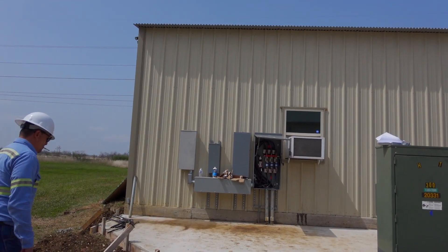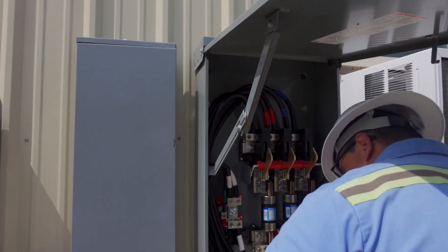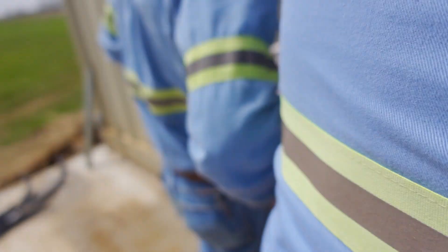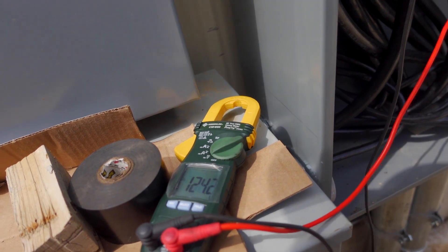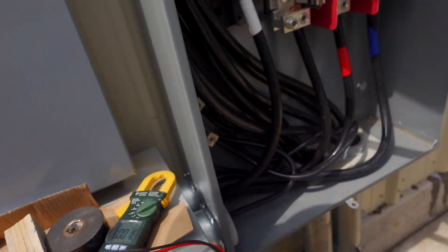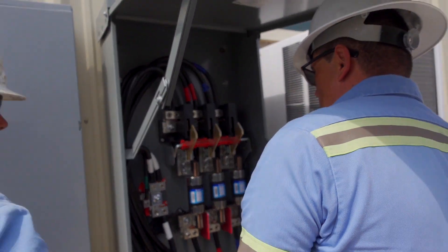It's hot. Now we flip that big switch — do you have your tester and gloves? Let's test it. We're reading 123, 124, 123 volts phase-to-neutral and 208 to 214 volts phase-to-phase. You get a little extra because there's no load; once you put a load on it'll go down to around 208. All right — we're good, that's clean power.